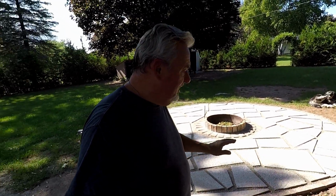We'll do that next. Well, we are finally done with this load of quarry wash, having it all packed in around the flagstones. And as I've stated before, it is a lot of work. It is hands and knees, hammer, wood tools, tent stakes, whatever you can use to get that packed in tight around those flagstones. Now that that's done, we're gonna get another load of quarry wash, lay it down on top of the stones, brush it in with a broom, water it down, leave it overnight. Then tomorrow, we're gonna get a bag of mortar mix, drop that in, sweep it around with a broom, wet it down, let that slightly dry, because most of it's gonna go down into the small cracks and crevices. Wet it down again, and that should lock all of these flagstones in place.